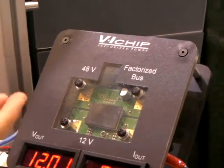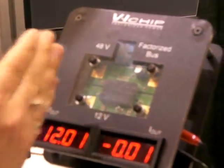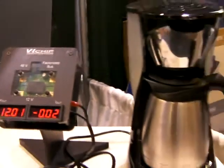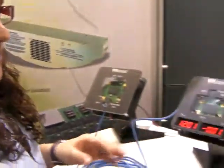So you see it has 12 volts. This also offers the isolation boundary — so this is where you have your isolation. Now what this particular setup has is what's called the adaptive loop. The adaptive loop will help regulate and keep the output voltage to 12 volts.